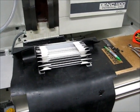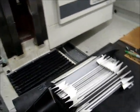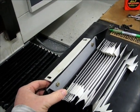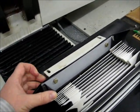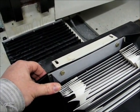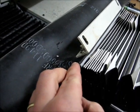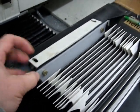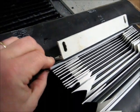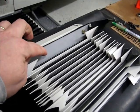This is just going to look like the Z-axis bellows and a couple pieces of neoprene right now until it actually gets on the mill, but I figured I'd show it at this point. I have made a few changes: I got M6 fasteners in here instead of M5, so I had to drill out the plastic cover and the piece of angle iron stock on the bottom in order to get the fasteners through — I needed something a little bit longer. Because of potential clearance issues on the inside, I inverted the bolts so the threads are facing downward, and I've clamped two pieces of neoprene in between the piece of angle iron and the plastic.